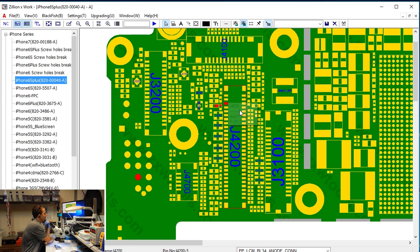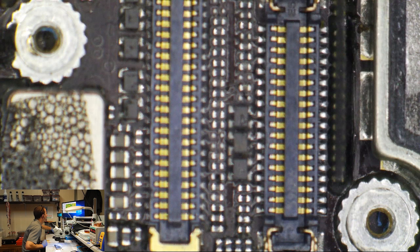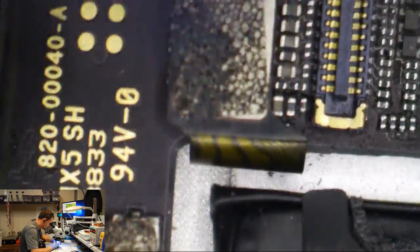As long as the little through hole via here is not torn, the little nub coming up inside the board, I'm pretty sure you call it a via, then we should get continuity between here and test point 25. Let's give that a shot. So we're going to go from the component they were messing with. Okay, so I get all this in view.